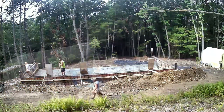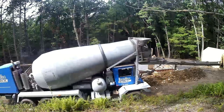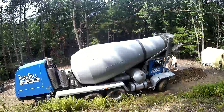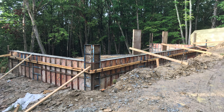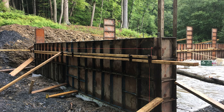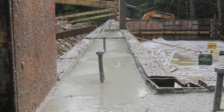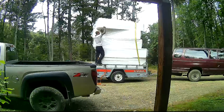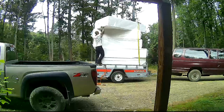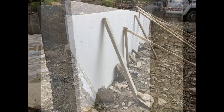I didn't know this. And these walls they built — how do you build them and know what looks right? Can you even rent these forms? Hire a concrete company in my opinion. Everything was straight. I put bolts in to fasten the sill plate. Besides rigid foam underneath the slab, I also put it on the outside of the concrete wall.